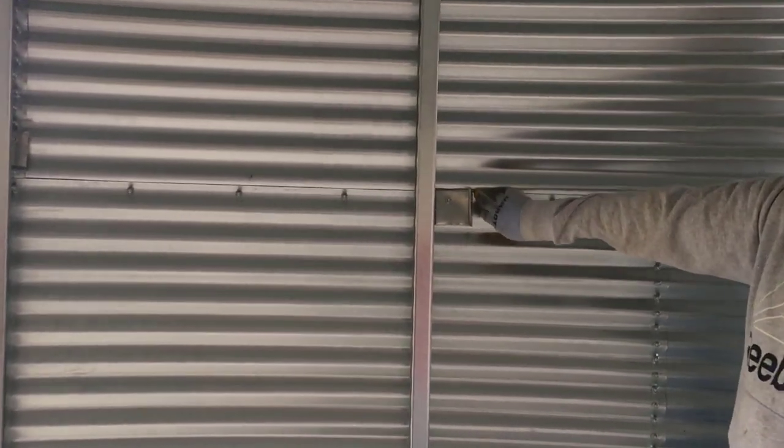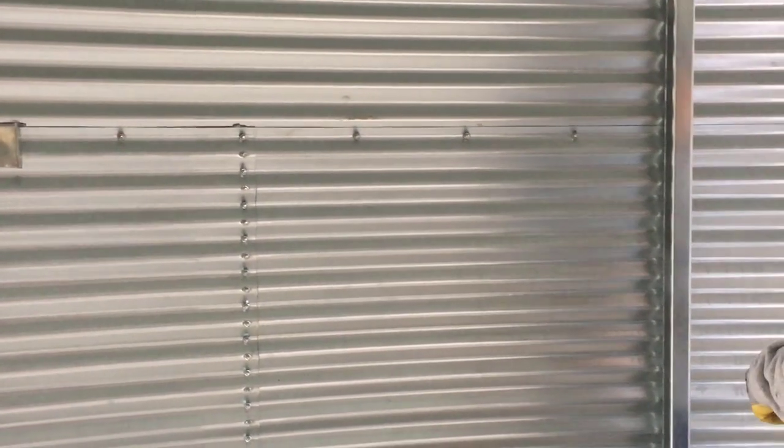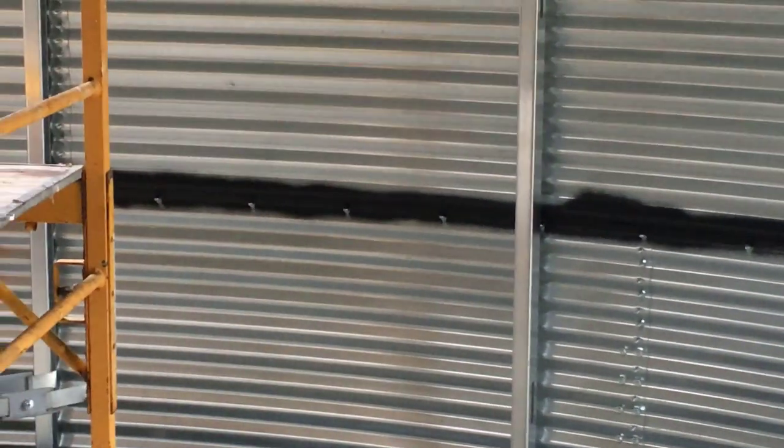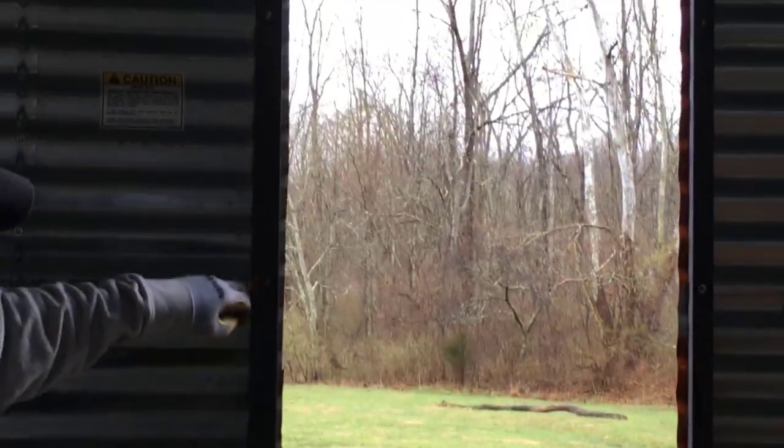See, right here I put a little weather seal in, because before I spray foam I want to make sure the seam gets sealed. So you're going to seal all the seams and then spray foam for insulation. I tried with the spray cans, but the flex seal — the black one — it's just a secondary, just in case, since they didn't put... Every window has braces, you can see them all the way up. They're all bolted to give the sides more strength so it won't flutter, and it goes all the way up there.